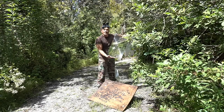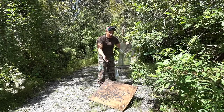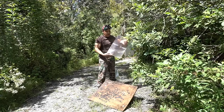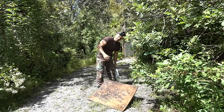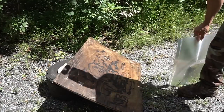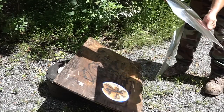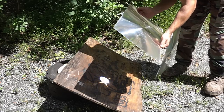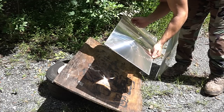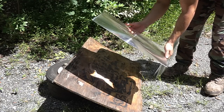The clearer the lens, the more light that is allowed to go through — more light transmission also contributes to power. But the size is the overall power rating of a lens. So this is going to be a single Fresnel lens all by itself. It's going to have a slightly funky focal point because it's not mounted to a frame, and you'll notice that I'm roughly 18 inches away from the target at the optimal focal point.